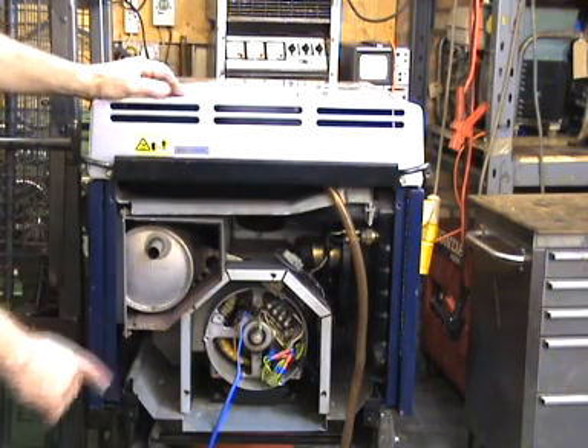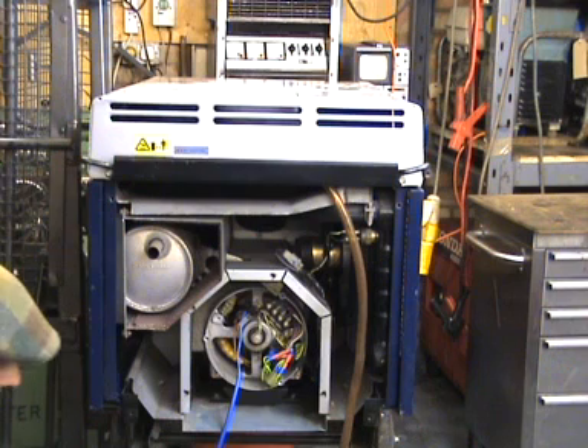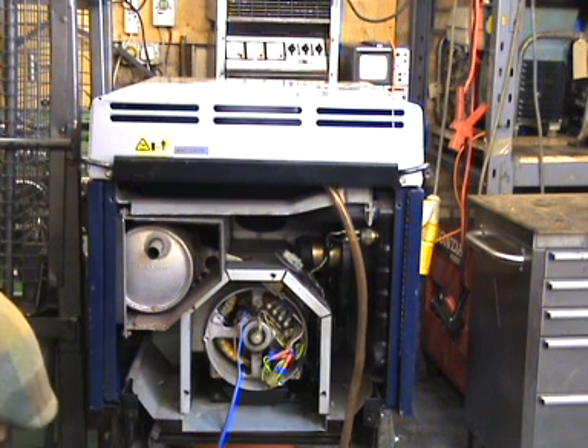The thing to remember, if you're going to do any of this: if you're doing this to a machine with no output and you've got no idea why, there could be all sorts of shorts and strange things going on in the alternator, which means that anything could be coming out of that wire you're putting on the battery. So you only want to dab it on — make sure you're insulated from any of these connections — because it's possible that you could end up with AC volts coming down that wire if you've got the necessary conjunction of faults in your generator. So just be aware — absolutely anything could be coming out of that wire.